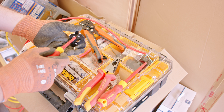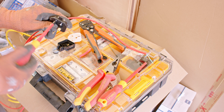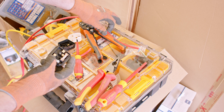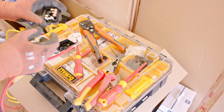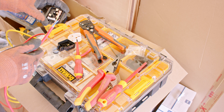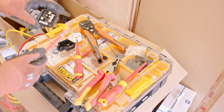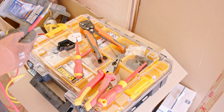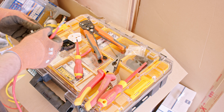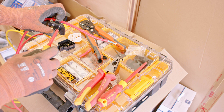For those of you who are not from the UK, this is a standard UK plug. You can buy these in grocery stores or, as we have, from a builder's merchant or electrical store. They're quite interesting because they're built for different times where metal savings were a big thing during the wars. So we've got a fuse in every single plug, which makes these quite bulky. But with a different length of wire here, it means that if you give a good yoink on this, your live wire always comes out first, then your neutral, and finally your earth. So it sort of protects the device which is plugged in and the user, making sure that the earth will always remain connected even after the other wires are disconnected, which means we have a much safer system. Quite fascinating — the history behind it and the engineering behind it makes it one of the most interesting plugs around.